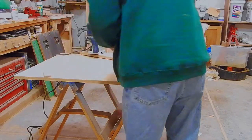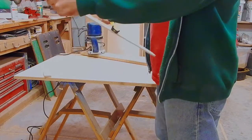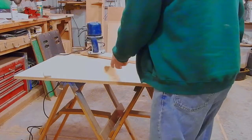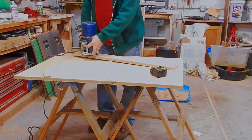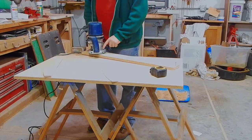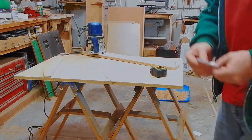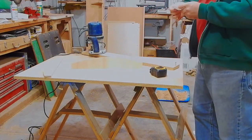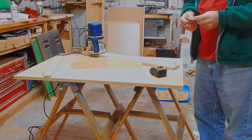The dimensions of this are about 18 and 3/16ths by three inches tall. What I did was create a compass with my router and screwed a pivot point down. I do remember the actual radius to make this specific arc work — it was 68.4 centimeters. I was using metric for that.